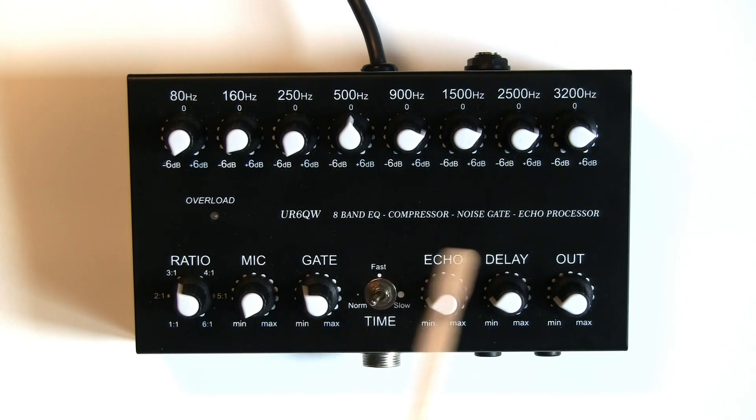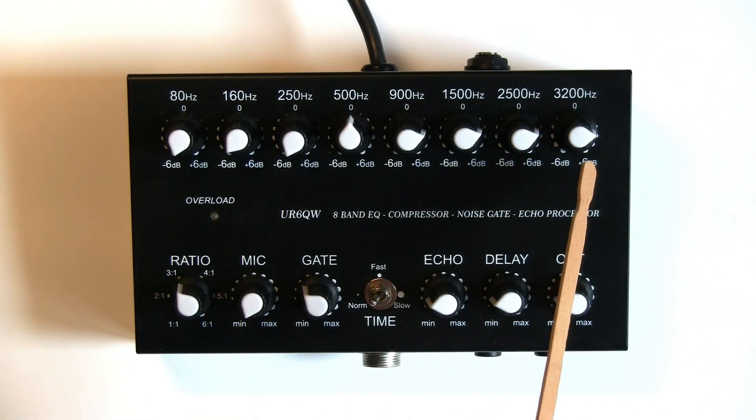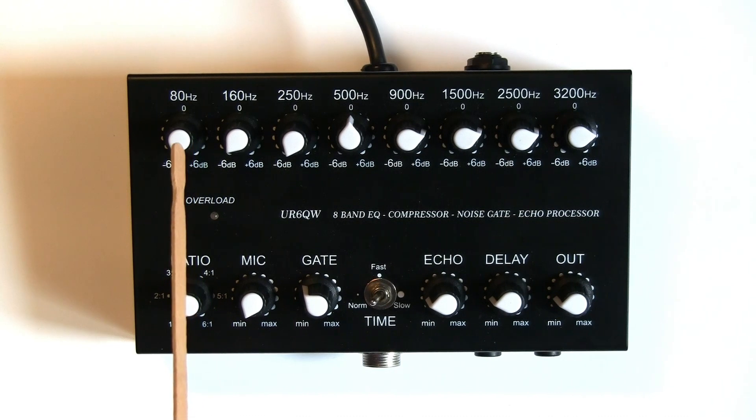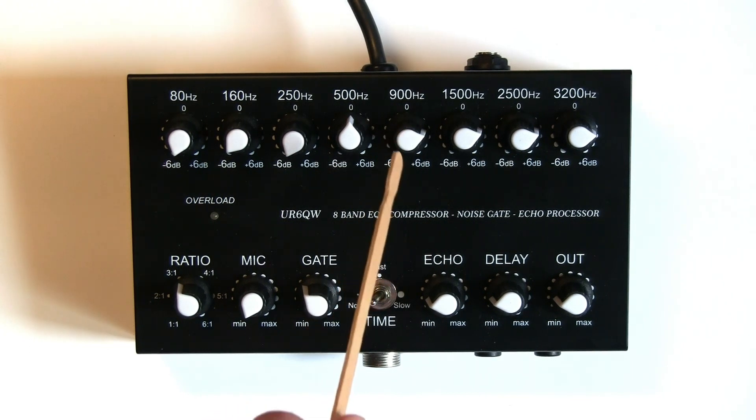So essentially it's grouped into three main groups. There's an eight-channel graphic equalizer from 80 Hz to 3200 Hz. It comes with quite a nice little manual. I've essentially configured this from the manual with a slight modification — I use a Heil headset rather than a stock mic, which I find to be quite bright in terms of its audio. So I've dialed down the upper frequency ranges a little bit — in the manual they were shown at full and I've dialed them back to about three-quarters, which is personal preference. This is the thing with audio and rigs — it's all down to personal preference. I think it makes the audio sound significantly better.